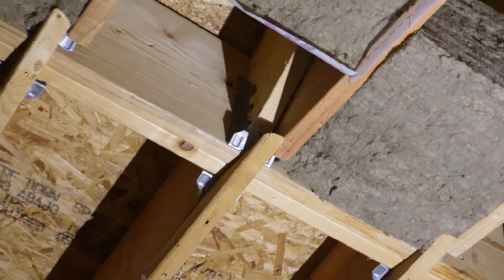These two pieces of equipment here were pretty much vital for the overhead stuff. We got away with just the cloth mask for the wall stuff. That's what ROCKWOOL's official recommendation was, just a cloth mask all you need. But the problem is the cloth mask fogs up glasses. So having the half-face respirator definitely helped with that. Also is a little more robust in keeping the ROCKWOOL dust out of your mask and out of your mouth.